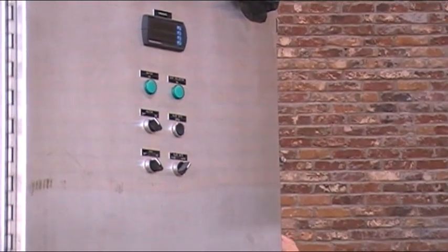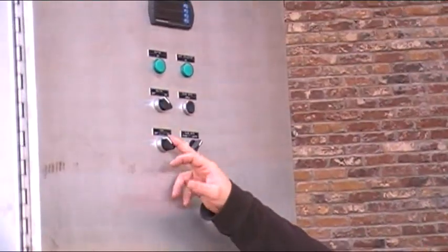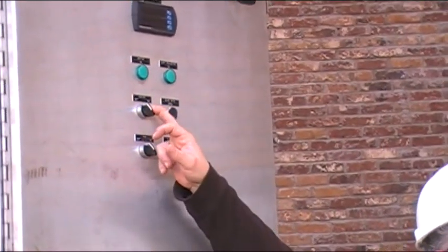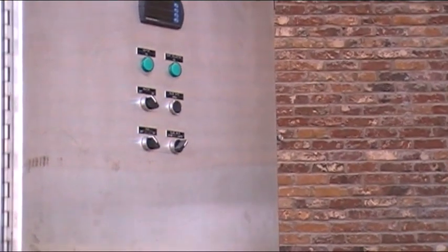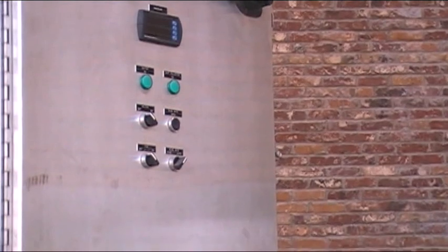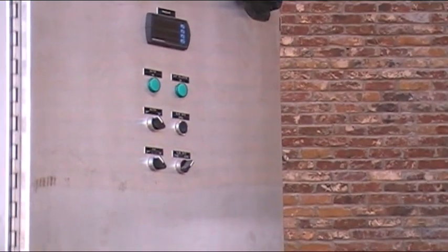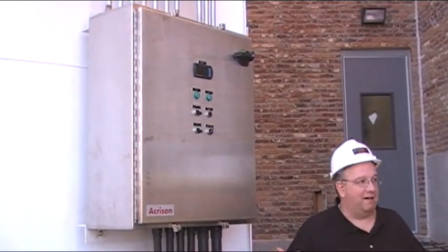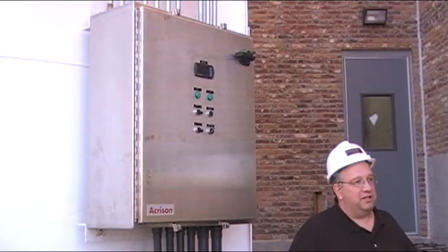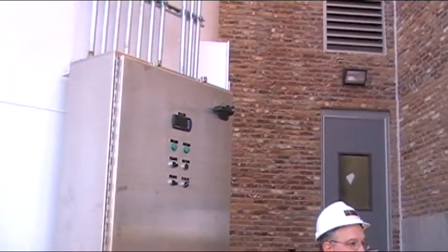Not the slide gate that's above the feeder — that's a good point because when I first saw that, I thought it was for that too. Then you have a fan and a heater. On a day like today you really don't need either one. But like a few weeks ago you needed the heater, and in about another month or two you're probably going to need to turn on the fan. The fan pulls hot air out of the silo and the heater warms up the inside. Right now they're both off — they're on thermostats set inside.